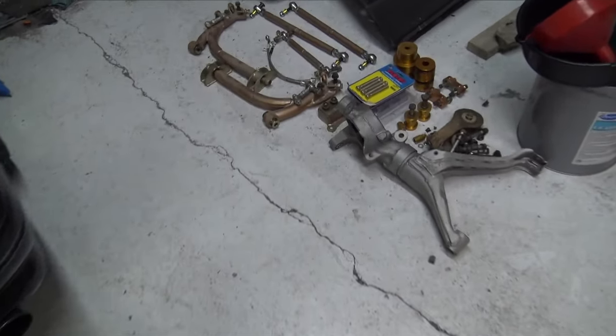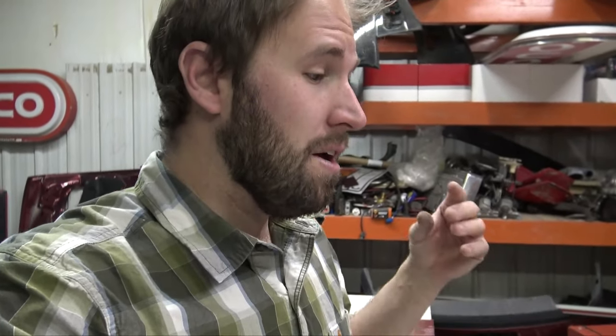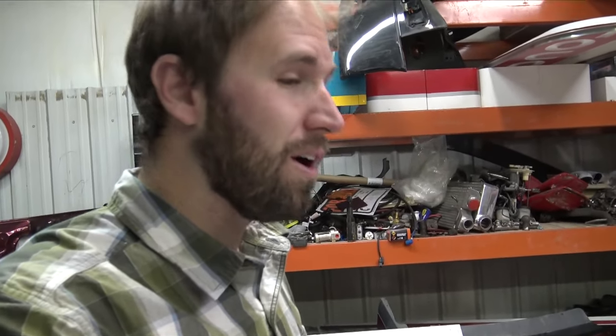And if it does, we're gonna try powder coating this lower control arm, or this rear control arm hub assembly for the FC. That's really the only reason I built this powder coating oven, so I could get my rear subframe and my knuckle and everything powder coated for the FC, so I could put all of this Power by Max suspension on it, and so that it looks proper. All the old components are really gross, and this will just make it look that much better. So let's try to fire this thing up, see if it holds 400 degrees.